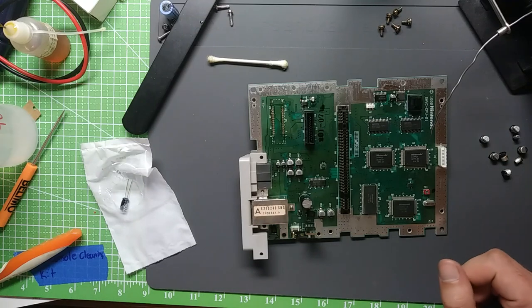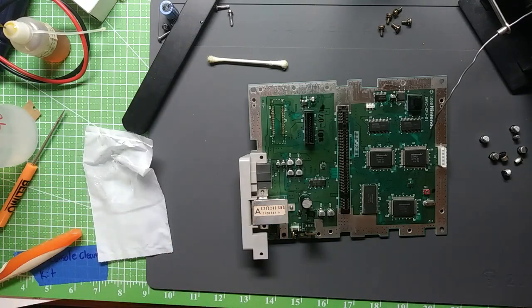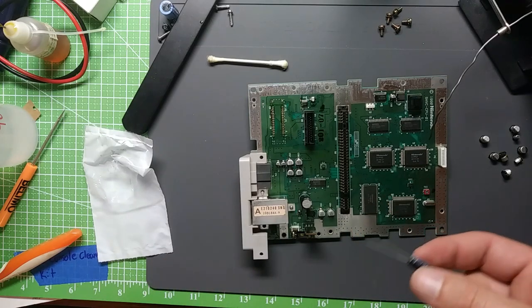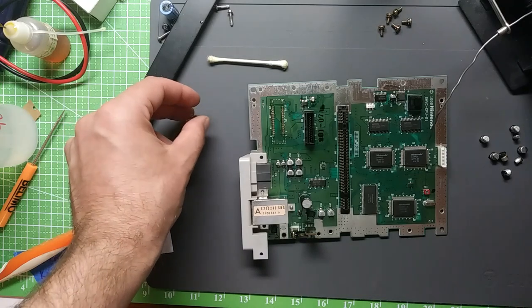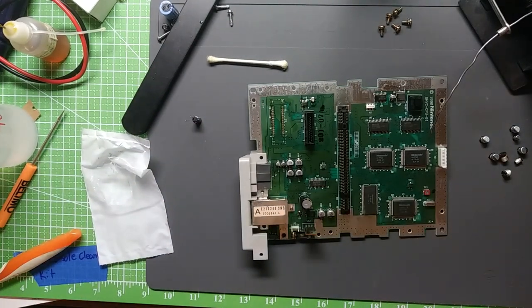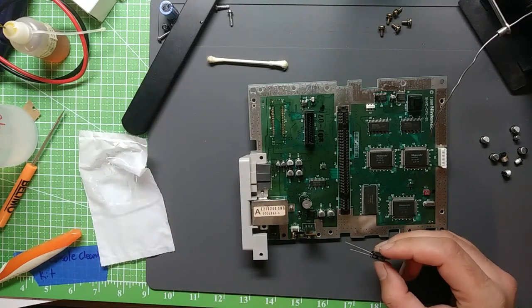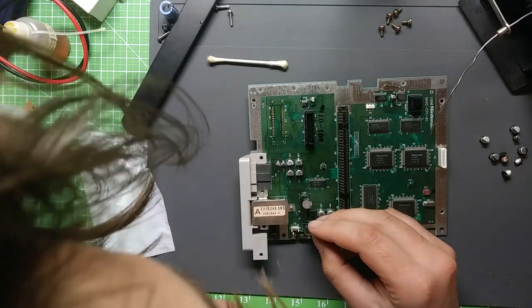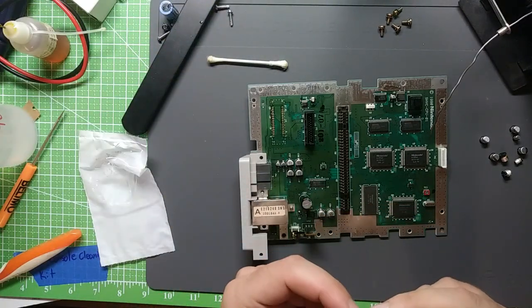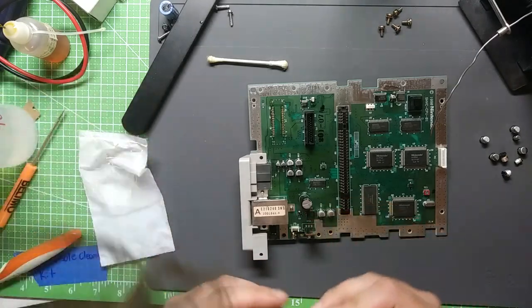Yeah, I think we're all good. This cap, I believe, goes between the output and ground. It's a recommended aftermarket addition there. I'm going to go check and make sure of that, though. Yep, it's supposed to go across ground and output for some additional noise mitigation. So I think I've done that before, is just clip these short and bend them 90 degrees there.